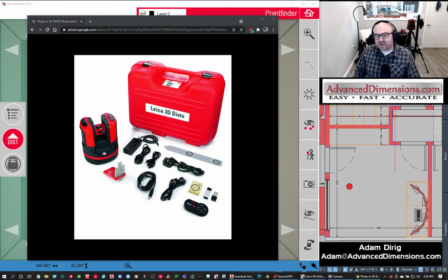So what I often do when I'm scanning is, the scan files can look completely different from job to job, all depending on what needs to be done. If you're doing wall paneling on a project versus a countertop versus checking the level of a floor, you're going to have a different looking scan for every single situation. So what I do when I walk into a job is I look at everything. The unit is a visual based unit, so you have to set the unit up to be able to see the points that you want to gather.